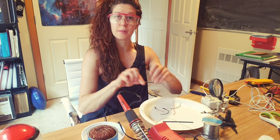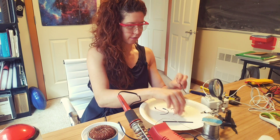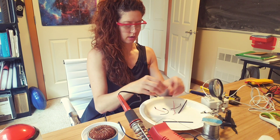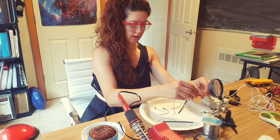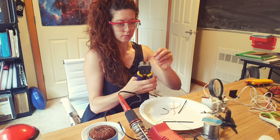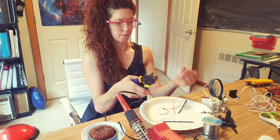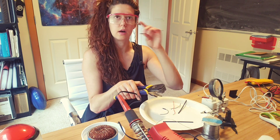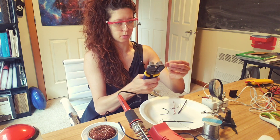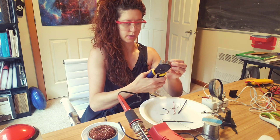The other thing I would recommend is heat shrink tubing. Cut a length of heat shrink tubing — this might be a little long, but that's okay — and then put it over the wire first before you do any soldering. Since I want to plug this into a servo, I want these kind of flat ends. It's also really nice for breadboards. Make sure your breadboard or whatever you're plugging it into is rated for the current and voltage of the power supply.